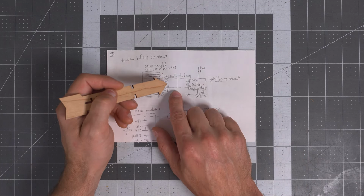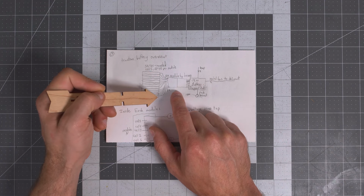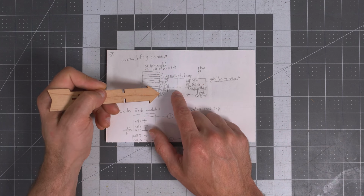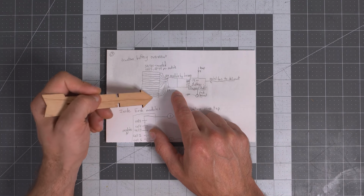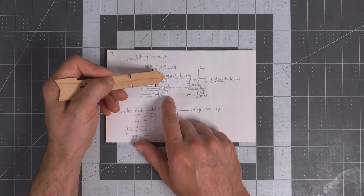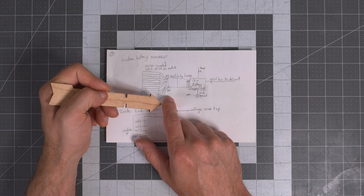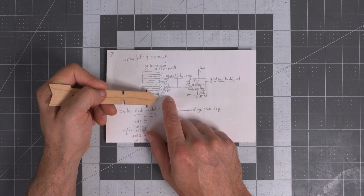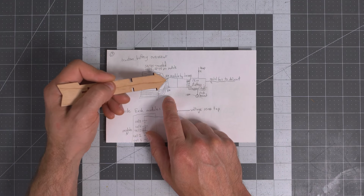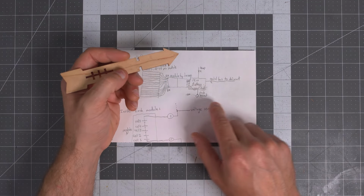So we have this harness, and this harness is hooked up to B0 and then B1, B2, B3. Now these are the modules. And so again, we're only measuring 14 points across the entire stack of, say, with the LFP, it's 70 cells, I believe, in series. And we're only measuring 14 series elements of those, and they're evenly distributed. We'll look at that more in a second.